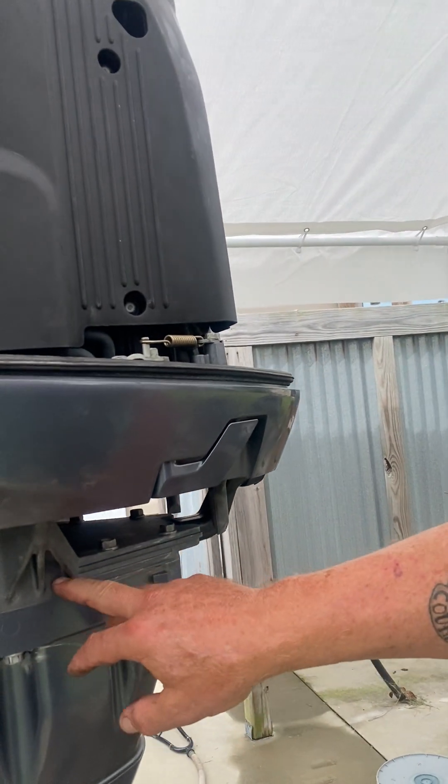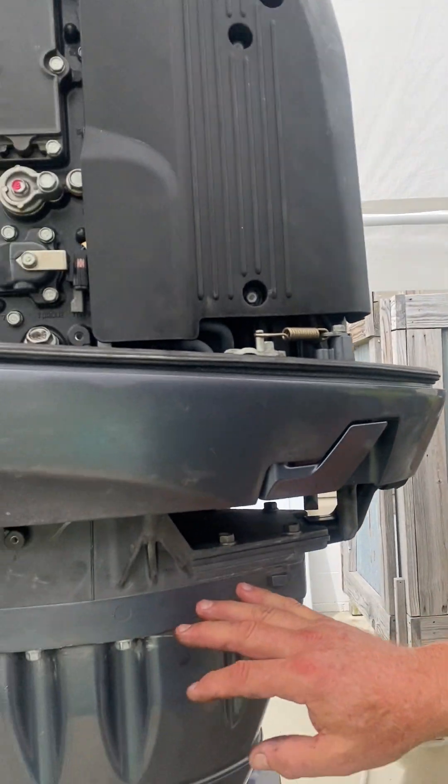Here's the physics of it: when you're just idling in the water, all that water is up in the prop causing back pressure. That back pressure gets up into the exhaust guide. Right here it runs considerably hotter than the other side. The water creates back pressure in the prop and the exhaust can't get out, so there's a lot of back pressure up in the exhaust guide — eventually it burns through. If you're a skiff guy with a 150 on a jack plate screaming along, you'll probably never have this problem, because once you're moving, the vacuum of the water helps pull the exhaust out through the prop.